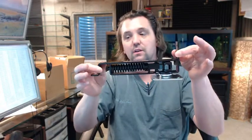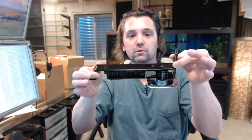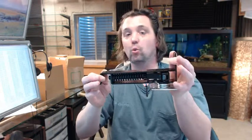You've got the spring unit attached to the bottom of the door, which is really step 4. Okay. You're going to want to make sure you've got everything calculated. You see in step 4 where it says 1 3/4 from the jamb to the center line of the pivoting axis. That's based on a 1/4 inch dimension. And if you take 1 3/4 less 1/4 inch, 1 1/2, which is a reference to step 2. At that point, step 5, okay, is going to get you where you need to be.